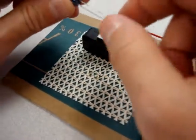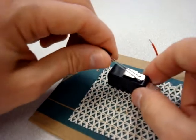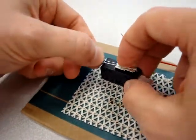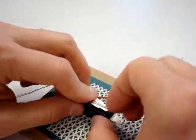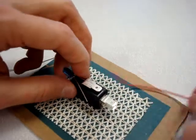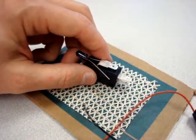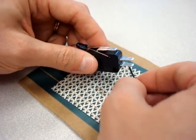The first most important part is this infrared bulb. The short post needs to go to this post on our limit switch. This limit switch has a little plunger here. And the long post is going to go to the red wire from the battery holder.